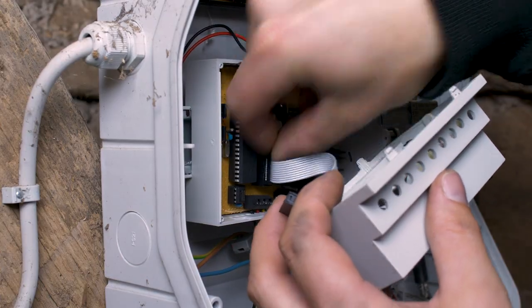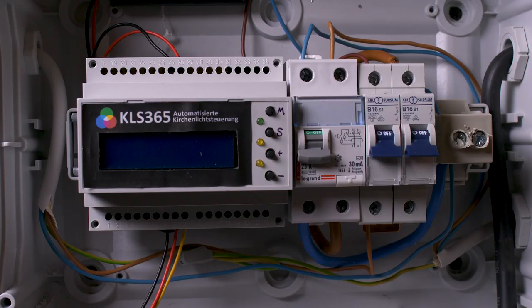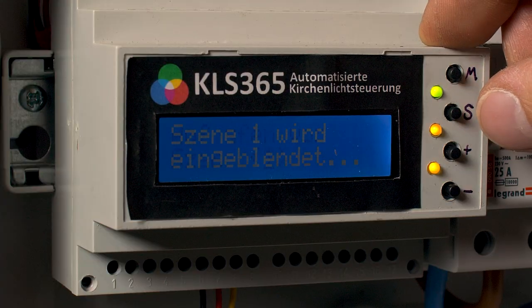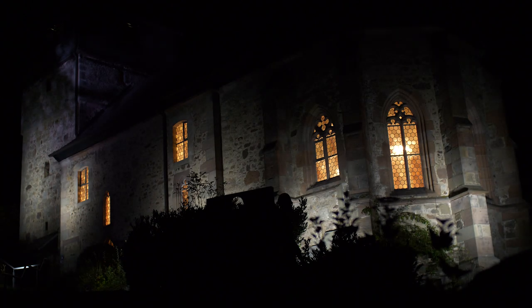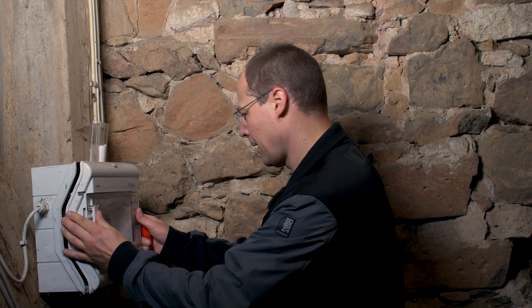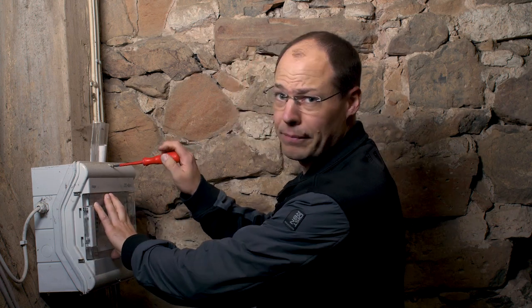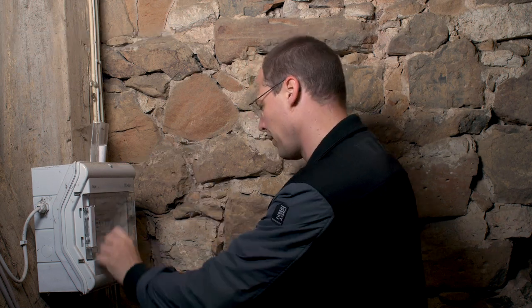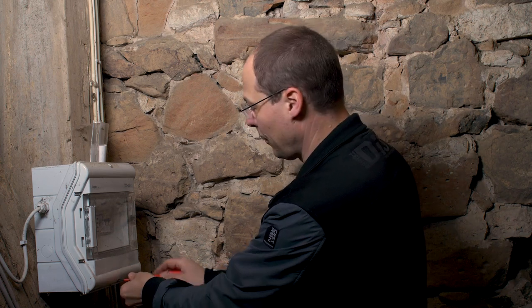Well done — it says OK. Let's put this thing together and see if it is working. And now turn it on — the RCD — and it's booting up. Firmware version 2.0, that's fine. Now that we have a current firmware version on this controller, we will see what happens if I call a scene. The control seems to work and the lights are on. But the new LEDs have a slightly different color than the old LEDs, so I have to readjust my scenes in the controller. This can be done without uploading a new firmware — I can do this through the menu.